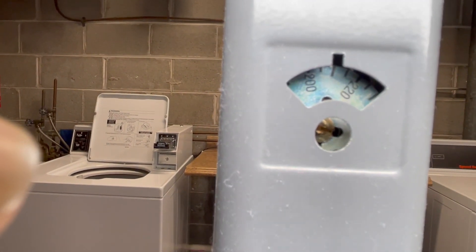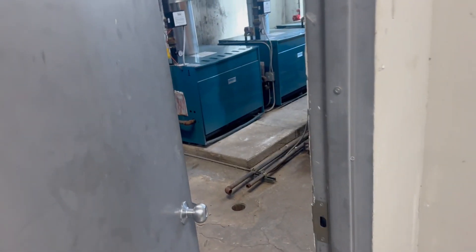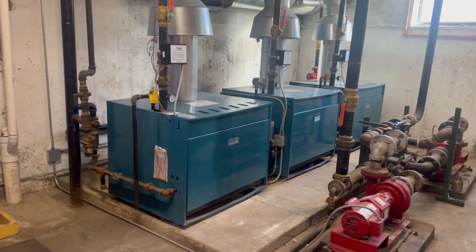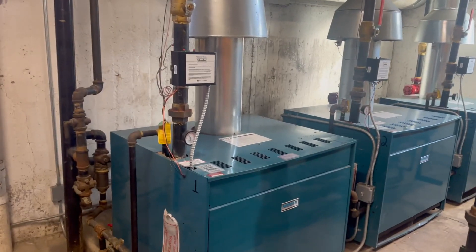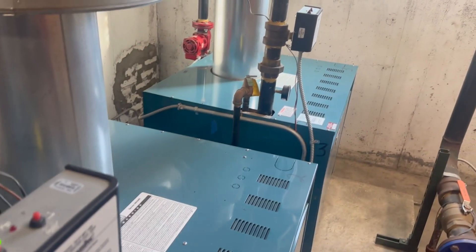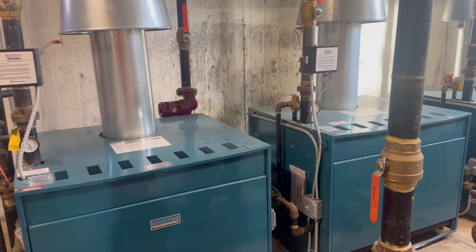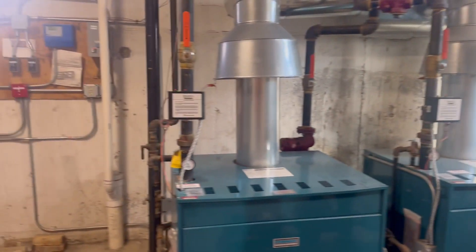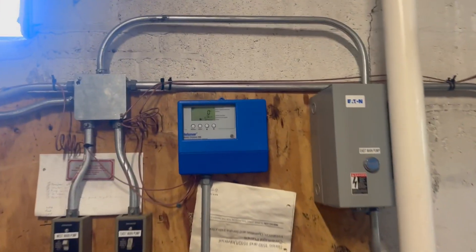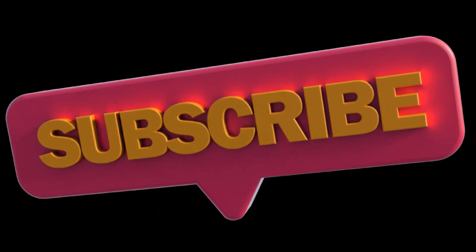I'm just going to show you — that gray square rectangular box, that's the AquaStat low limit settings. And this boiler dial is right there, but we're not going to do anything because it's very good there. The high limit on this one is 210 — I like it there at about 20 to 30 degrees differential. Now I just want to show you this property here. This is a four big building complex, and instead of having one massive boiler, it has three 500,000 BTU boilers. They work in synchronization. Right now all three are on because it's very cold outside. But at the beginning of the season if it's not that cold, only one would work. If it's colder, a second one kicks on. All of this is done through a computer — Tekmar, that blue thing — so all the boilers work at the same rate. Remember, it has to be a difference of 20 to 25 degrees between the low limit and the high limit. If you like this video, please like and subscribe, and we'll see you next time. Thank you so much.